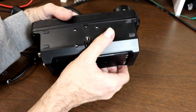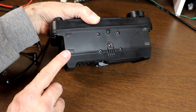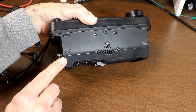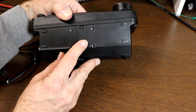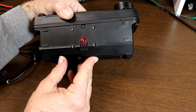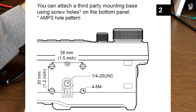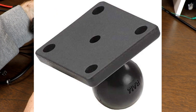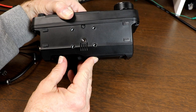The next thing I did was to attach the self-adhesive rubber feet that came in the little package on the sticky sheet, on their four outlined locations on the bottom of the radio. I'm not quite sure why ICOM didn't just install those at the factory, but while we're looking at the bottom, there are a couple other items to note. There is a 1/4-20 mounting hole to use with a standard camera tripod or any similar accessory, and there are four M4 threaded mounting holes that match the AMPS hole pattern, compatible with RAM and several other brands of mobile mounting brackets. I've been using RAM mounts for most of my mobile gear for several years now and I've been very pleased with them. I put a couple of links in the description for some different ball plates that match these holes.